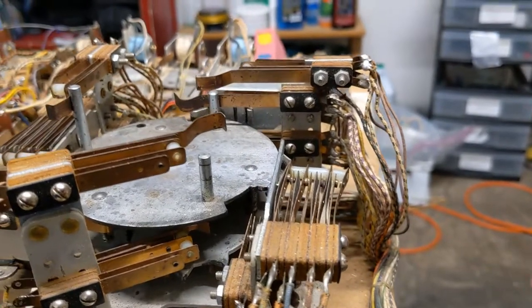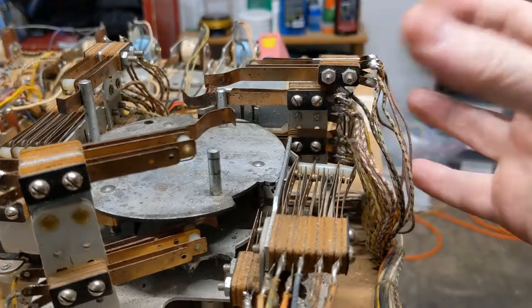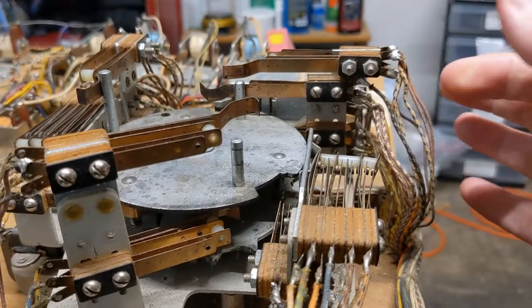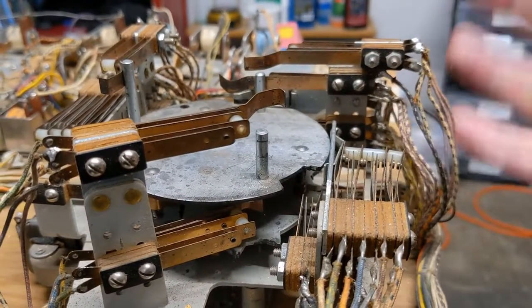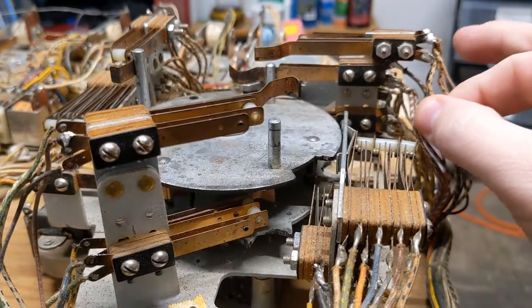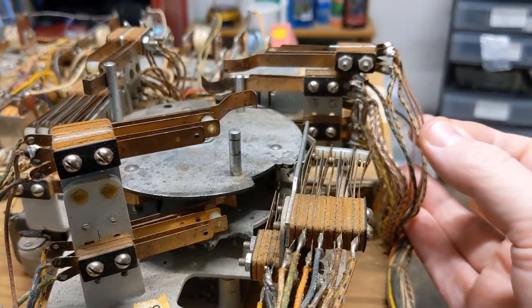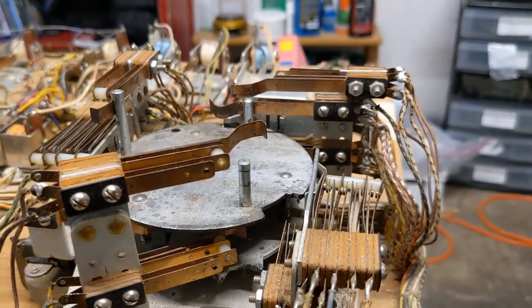Now, what had happened was I was going through it, checking again. I was clamping on there, and checking it. What I didn't notice, when I was going through it, was I went through and checked it again after I pulled it out to go through it again. I was, oh, what's going on? And popped right off. The solder joint on the lug had gone cold.